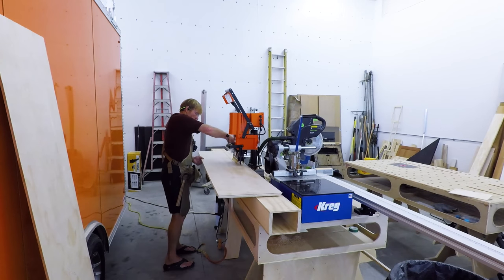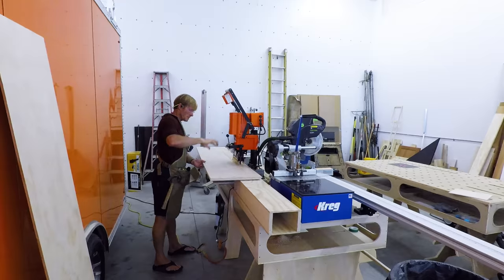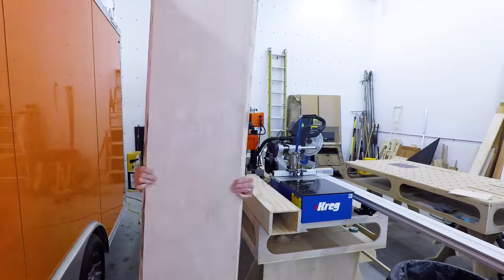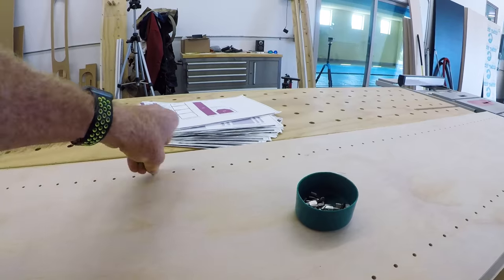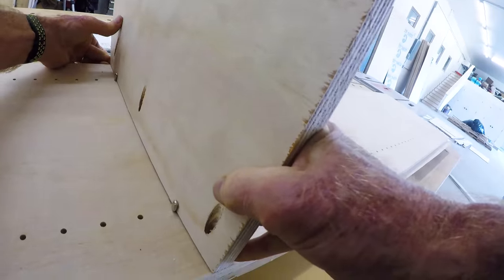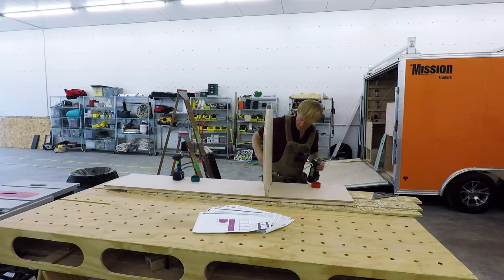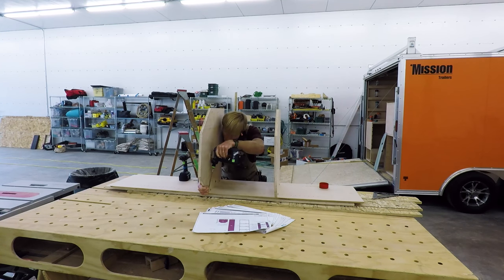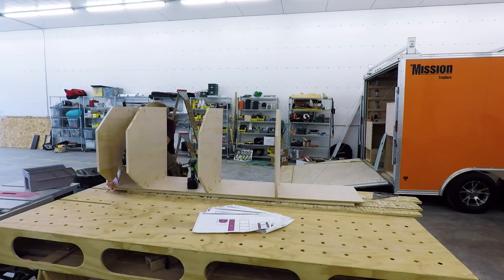To screw it against the wall, I'm using the Blum press that drills seven holes at a time and uses an index pin. It's not a tool to buy for general purpose — if you're building cabinets it's worth having, but you're going to drop about five thousand dollars by the time you buy everything you need. Really not recommended unless you're building lots of cabinets, but it's a great tool if you're into production.